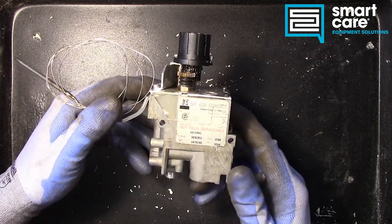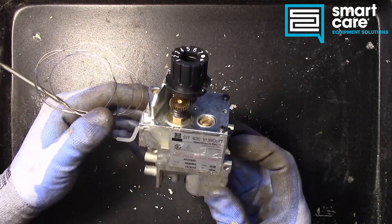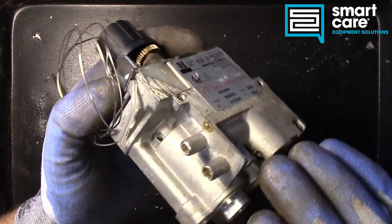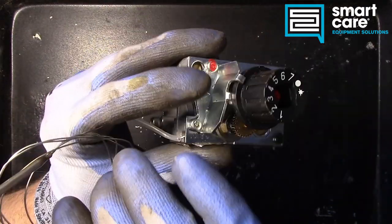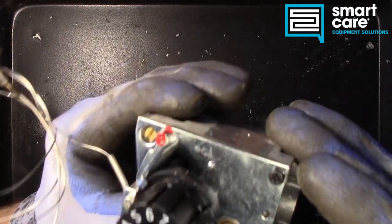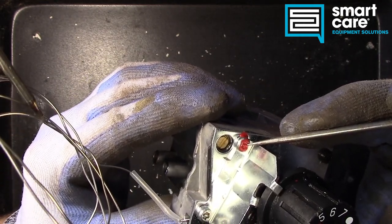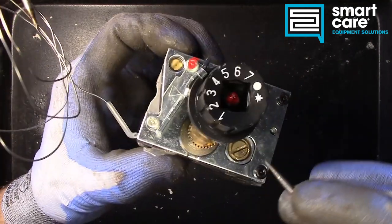The valve was sent in by a field tech — thanks for getting that sent in, I appreciate it. This is a used valve, so I'm not sure what failed on it; we'll have to take a look as we go. There are a couple of other screws here, some small adjustment screws — I'm not sure what these do yet, but we'll find out. These may be like bypass screws. To begin, when we look at how this thing is put together, we know we've got a cap tube and bulb over here, so there's going to be some kind of bellows up under our mounting plate. But our entire mounting plate is held in with security Torx — that's the regular Torx but with a tiny pin in the center — and some of these are coated. So that'll be the start: getting these security Torx out so we can get this top plate off.